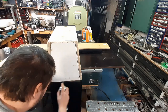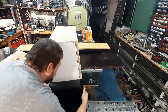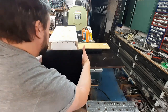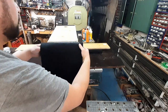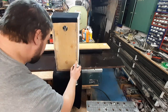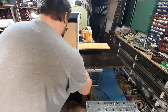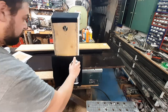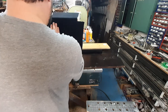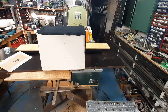And when put in the ported box, the internal pressures are higher than in a closed box because of the resonating body of air in the port tube. The speaker produced really, really loud air rushing sound. The closer to the resonant frequency, the more of the sound there was.